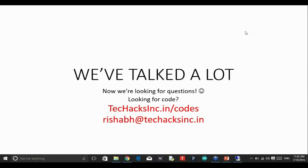Rishabh? Yes? Is Victor here? Just to complement your answer, very good answer first of all, but just to complement about Zigbee: Zigbee technology has a new paradigm of communication. Zigbee technology can support mesh networks. With mesh networks, we can reach more distances because we can communicate from one device to another device and make a chain, where one device communicates to the next one, to the next one, and then you can reach almost anywhere because you just need to have a new device near a device, and then you can replicate the message.